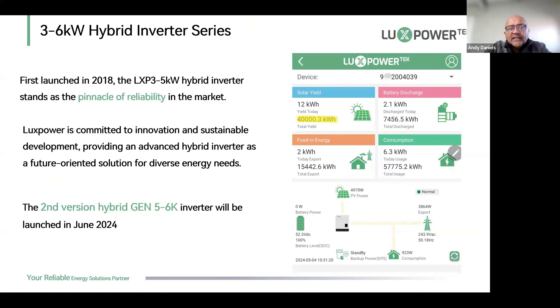You're purely going to put in one AC supply line from the mains breaker to the inverter with a 32, 40, 50, or 63 amp breaker depending on the inverter size. In the settings you set it to run without battery, fit the requisite number of solar panels, and the machine works as a grid-tied unit. It will harvest solar and feed it back to the DB without exporting, or if your municipality allows export to grid, it will supply the load first and then export the balance.